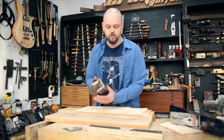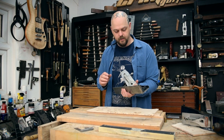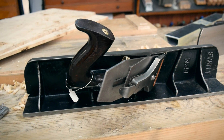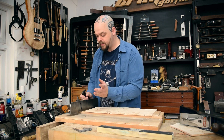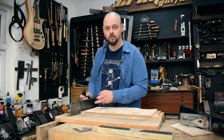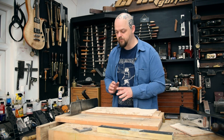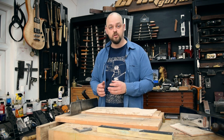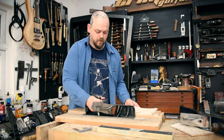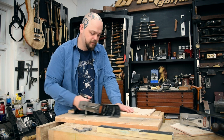This is a dedicated shooting board plane. This is an old Stanley No. 51 and it's beautiful. They are rare and collectible and awesome. The reason — there are several reasons. It cuts on the slice, so your blade is going through at an angle, a skew mouth basically. That is very, very cool. It means that you do get a better cut with it, but also the handle is designed specifically to work well like that.